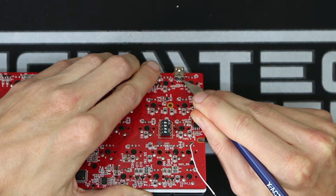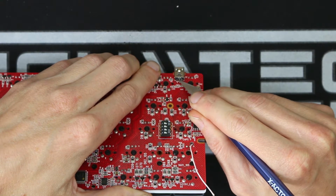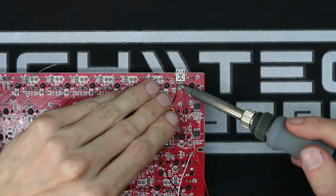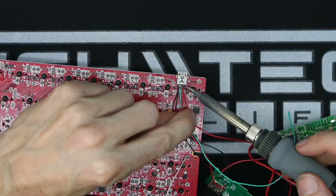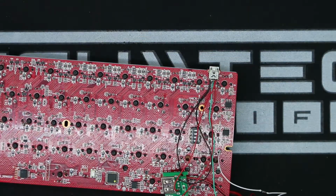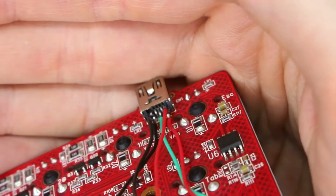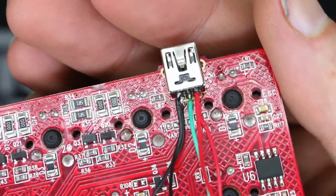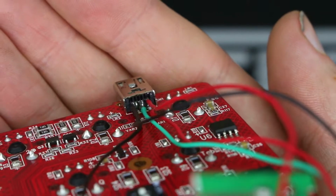All of these wires are converging in this one spot, and none of them can touch each other nor the outside of the connector. And here we go, wiring it all back up again with 2 extra wires. At this point, I had attached and reattached them so many times that I was getting better at it, but it still was far from easy. The mini connectors actually have 5 pins, but one of them is an ID pin, which isn't used. So that's 6 wires total, 4 power and 2 data. And now that that works, we can move on to more case mods.